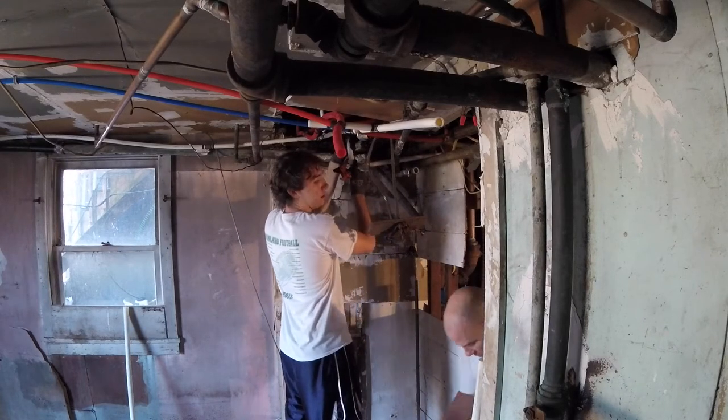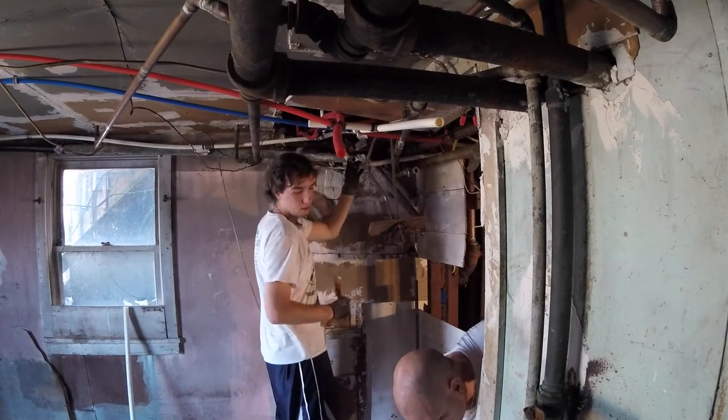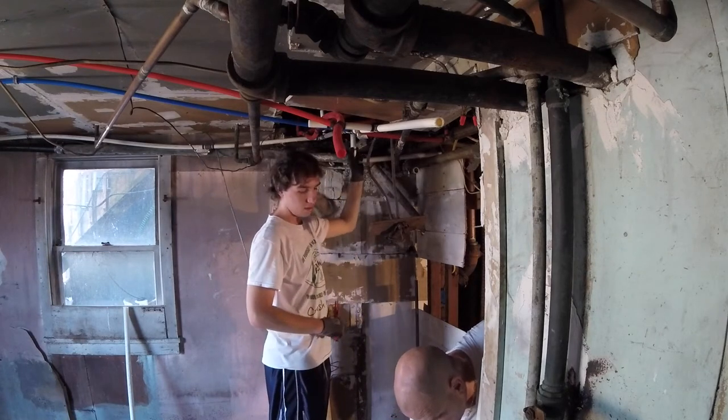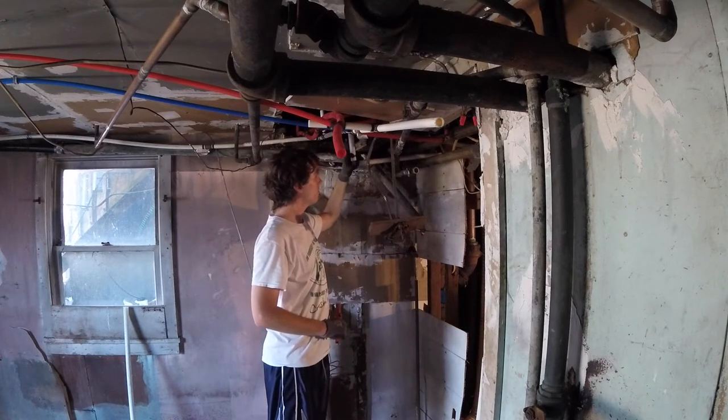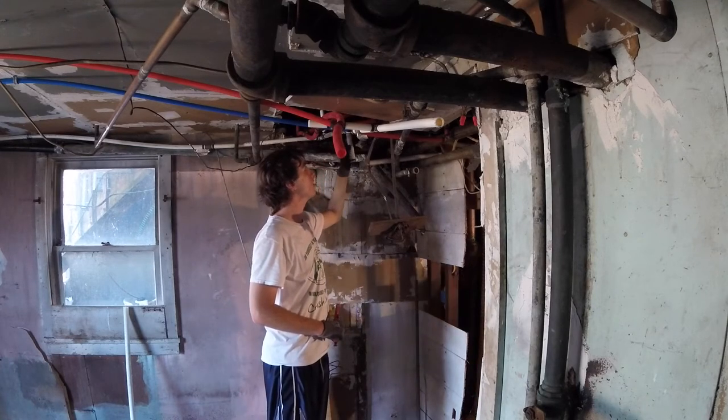Listen, when you come up, pull me a T right here, just like this, facing straight up to the door. Good. And we'll put a boiler drain right there. This way we got some water in the building. Okay? Got it.